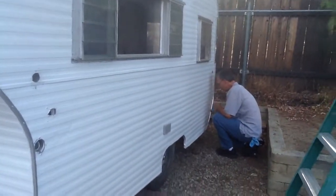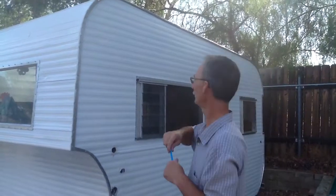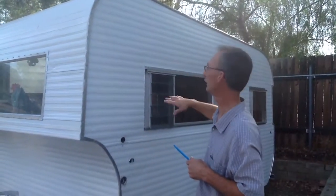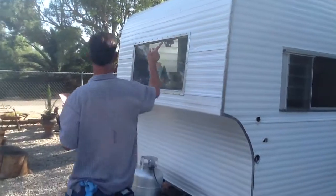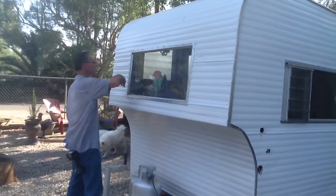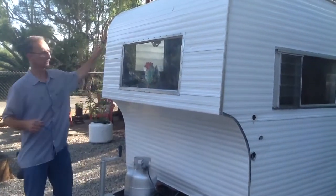Tell everyone what you've been doing here for the last few weeks. So we painted it, and then we took off all the windows, took out all the corrosion off the windows, and then we resealed them using silicone around the edges. The front window we had to reframe — from the inside we put in a new header, a new footer, and some strut supports so we could actually bolt the window in again. We resealed that.